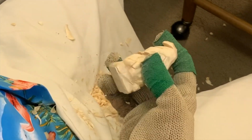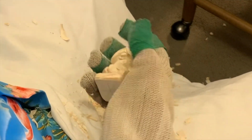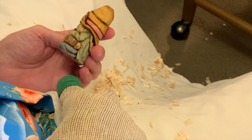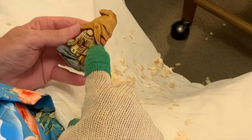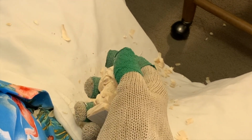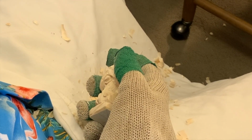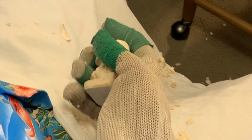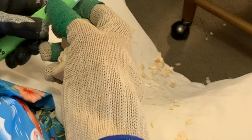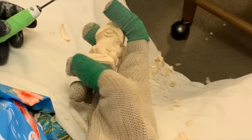Let's go ahead and kind of finish up with some folds and creating some of the illusion that we need to have these little legs crossed here. You can see, right, one leg on top of the other. Folds here, folds in the coat, in the arms, the sleeves, that is. All right. And so to achieve that, we'll go ahead and use some gouges and also V-tool. All right, so this is a 60 degree V-tool.